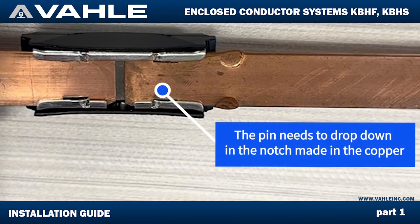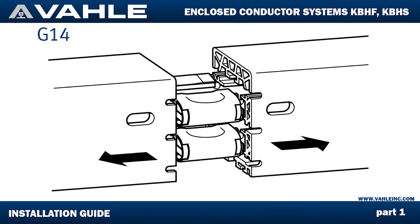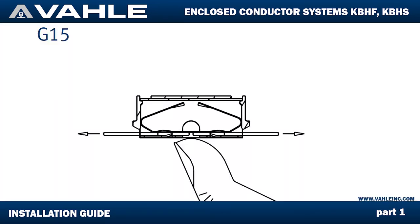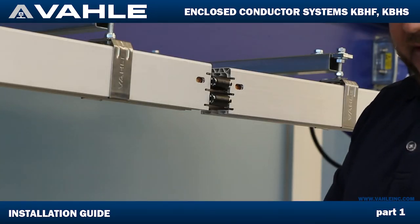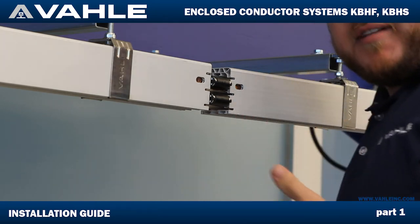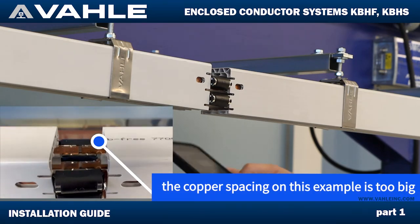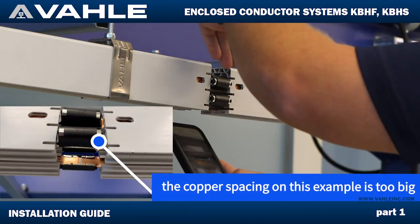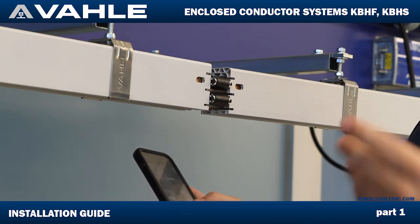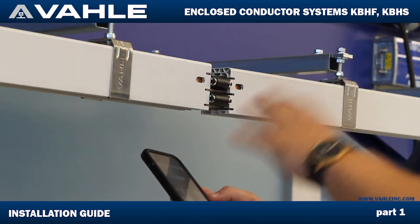You're going to take the housing to the right and pull it to the one to the left. Go ahead and inspect all the joints. The best practice I would say is to grab your cell phone — you can't really get on the other side with a hard hat on. Take your phone, reverse the camera, go in there and look at it so you can see the back side. If you really want to protect yourself and verify down the road, go ahead and take that picture and upload it or send it to your supervisor. That way you have a record of every joint being properly put together.